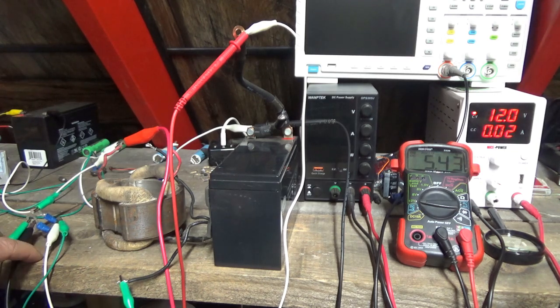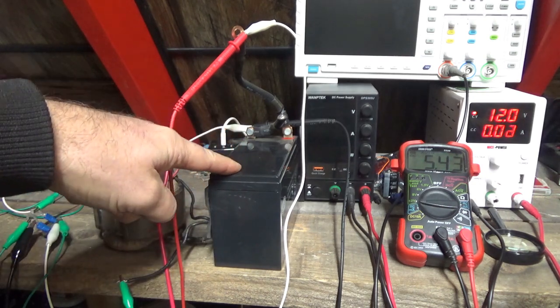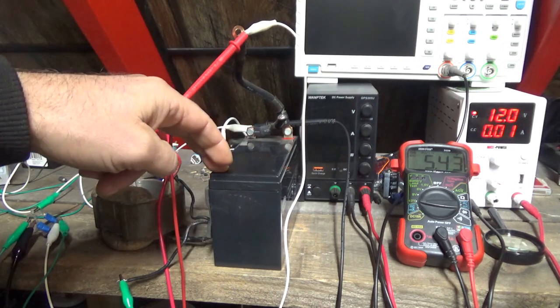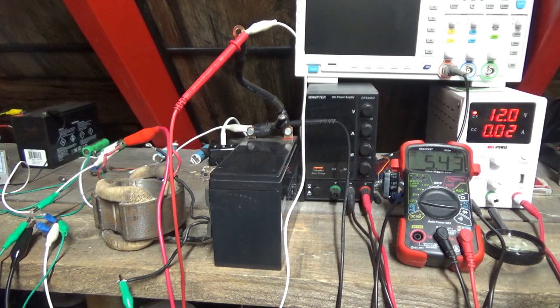I am working on a commercial product for sale, which is going to very much beat out the stuff that is available on the market today, which I will also show you. I have ordered a commercially available device to do a side-by-side comparison with once I get the right combination and show you the huge difference between what I'm building and what's available on the market, and how my design is definitely going to restore batteries better, faster, and including batteries that have no charge in them at all from the beginning. All the commercial devices require that the battery has usable energy in it and enough voltage for it to draw from the battery. It runs off the battery it's charging, which is basically useless if your battery is at 0.5 volts or so.